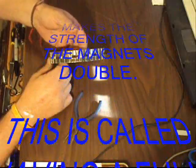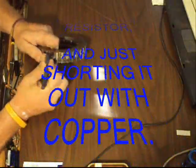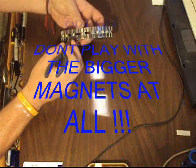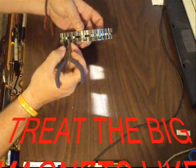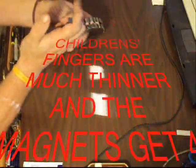About the only way to get this apart without really risking chipping the steel or damaging it is to move the magnets around to the other side. Now they're through the one-inch by two-inch by three-quarter-inch — the big ones. It's like taking these two and stacking them here, and also taking these two and stacking them here, making these ones twice as powerful and these ones twice as powerful. And that, right there, is a smart way to use magnets — get everything you can out of them.